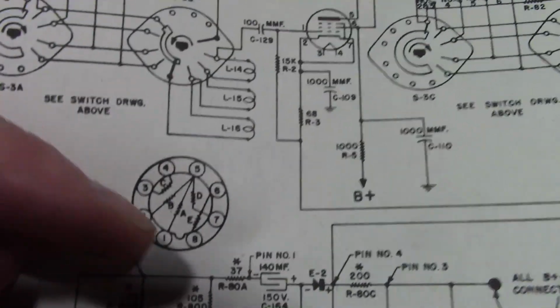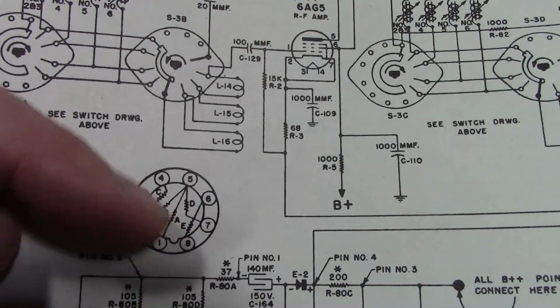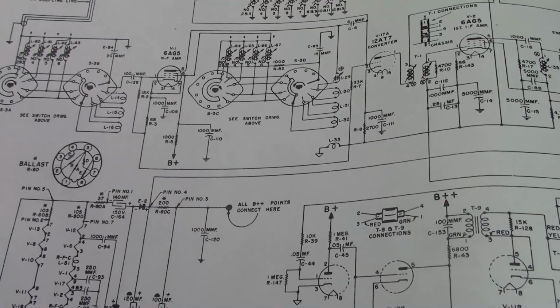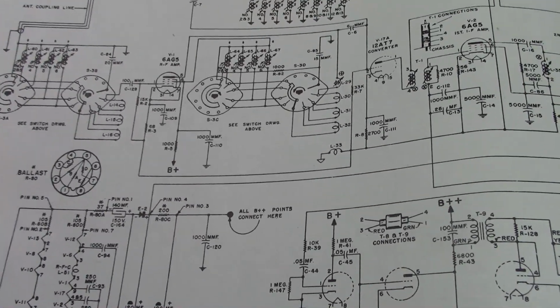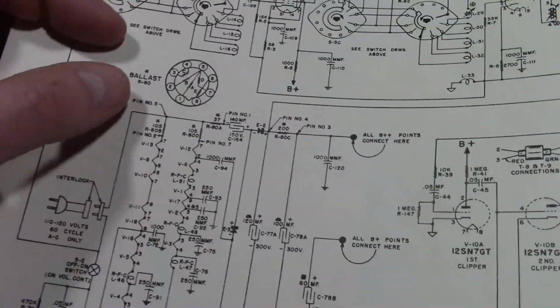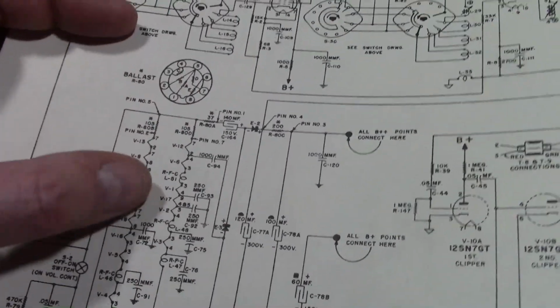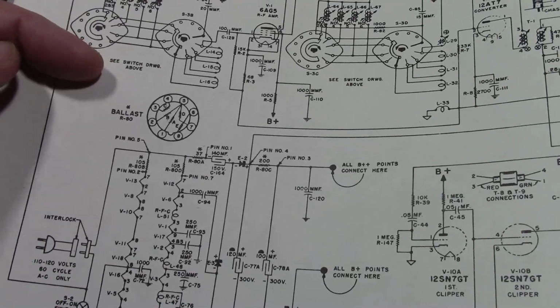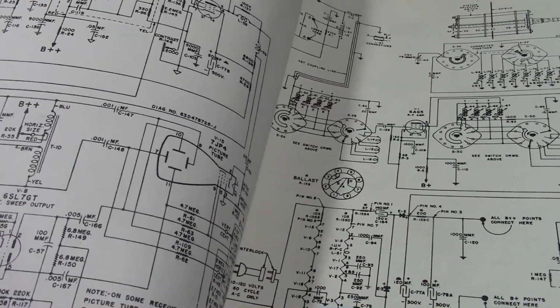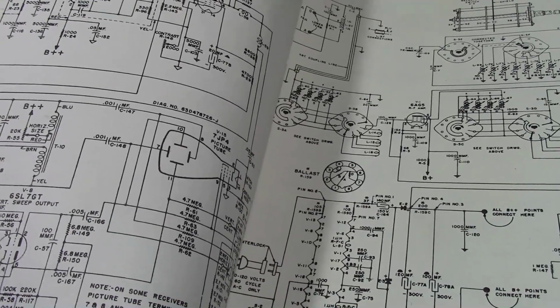And notice that this has one more resistive element in it. This guy here, this E. Well, the really early revisions used one tube in the string that, things didn't work out so well. And they had to put a resistor in parallel with one of the tube filaments to get the currents to equalize out. Later revisions didn't need that, so eventually they just used a different ballast altogether.